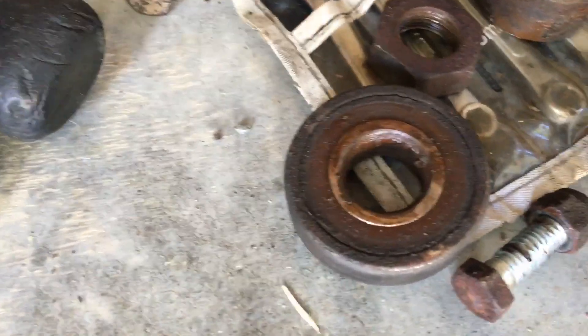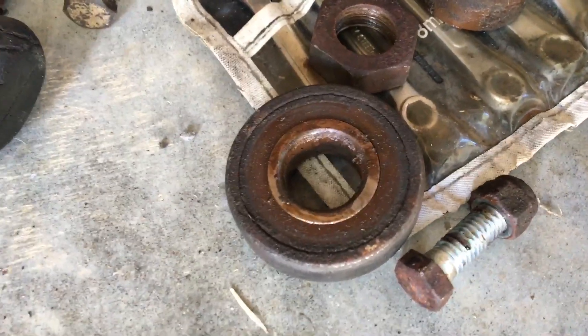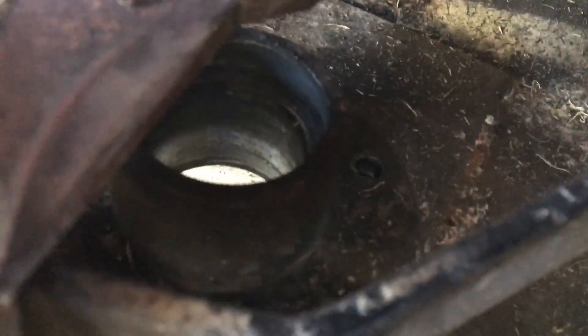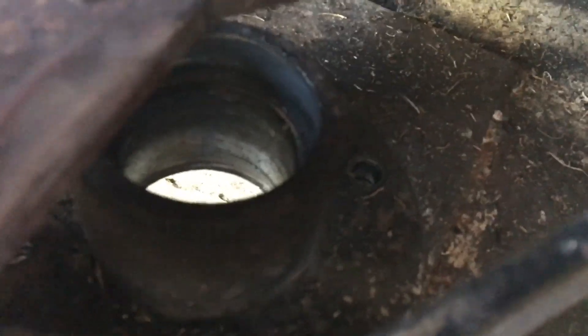Here's one which is okay — that's the top one which I thought was bad, but it seems fine. What it's actually done is I pull the top part apart here and it's chewed up all inside there, inside the hole. I've taken the bolts out but they won't move, so maybe I need to whack it a bit harder with a bigger hammer. I might actually need to machine that out and get it bigger and put in a larger bearing to make it fit.